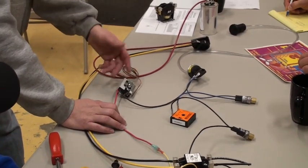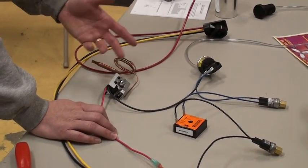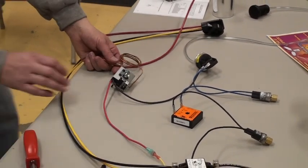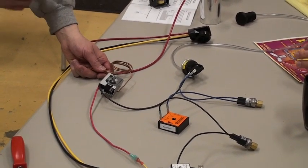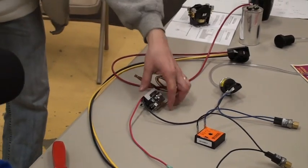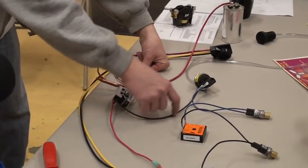It going here first is just a matter of wiring, but the thermostat would be the first thing to call for heat. If you have it set to where you want it, and this sensor is sitting here inside the heat exchanger watching the pool water flowing — at some point the water's going to be too cold and this thing is going to start to call for heat. And all it does is activate this electric switch in here and send it on down the line.